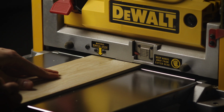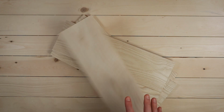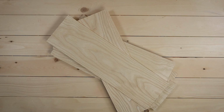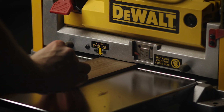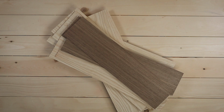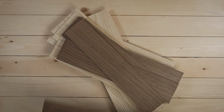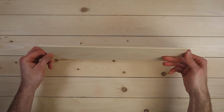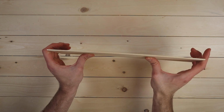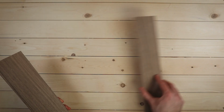I've seen some absolutely incredible versions of the Deku Shield that people have made online, but it always bothers me that every replica I see seems to be flat, while in the game there's a subtle curve to it. I'm going to try and solve this by doing something called a bent ply lamination, which is effectively the process of building my own plywood from scratch. Plywood is made up of a bunch of thin layers that, unlike thicker wood, are bendy and malleable. So by turning our solid wood into these little strips, we're going to be able to bend them into shape when we glue them together into their final thickness.